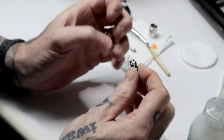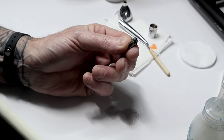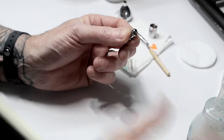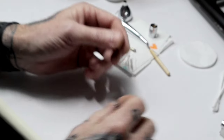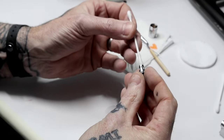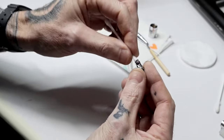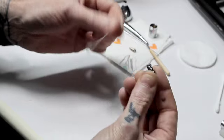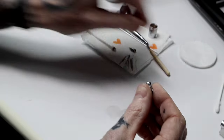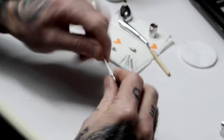Your front air cap is a fixed piece. On this air cap you've got a rubber ring around here. I wouldn't soak these in thinners because over-soaking with an aggressive cleaner will cause the rubber rings to swell up. What I would do is get your cotton bud, drop a little bit of cleaner on the end, poke that in there and twist. This will clean the paint off your nozzle at the front where you will get a build-up of paint.